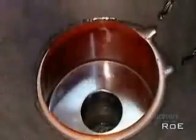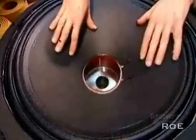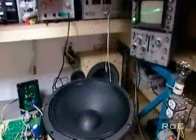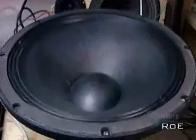The current coming from the amplifier travels by wire to the two terminals. The terminal wires connect to the voice coil wires. After making sure the cone moves freely without rubbing, they glue on a rigid cardboard cap to keep out dust. The last step is to take the speaker for an audio test drive.